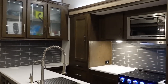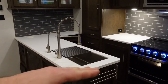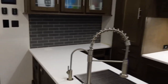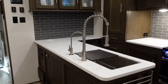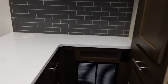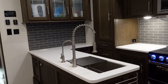This is an L-shaped kitchen. Walking in, it's almost like an island but more of an L shape attached to the wall. Later builds I've seen have a true island pushed out a bit more, giving you walkway separation from the coffee or taco bar area against the wall. The L shape has pros and cons — I liked it because it gave me a kind of chase for running plumbing and electrical upgrades, and you get a little more counter space. The downside is it's really a one-person kitchen — if someone's in here cooking and another person comes through, you're pretty much stuck until they move. Both the L-shape and island have their merits.